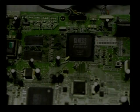This is pretty typical. This is a BGA chip on the right, a really ugly, nasty chip to rework. Those are probably DRAM chips on the left, and then there are some flash ROMs and a little glue logic and passives around there. This is a good clue that this is definitely a logic board. And you notice how small those wires going in are on the top? Those are like 22 gauge, those are going to be signals, and even power on the right is not very beefy.